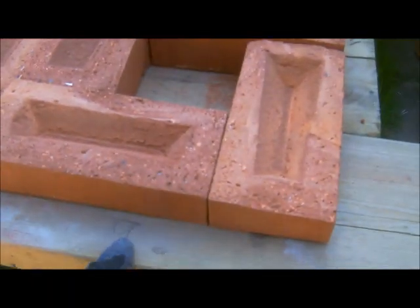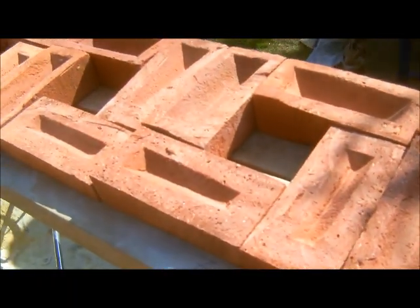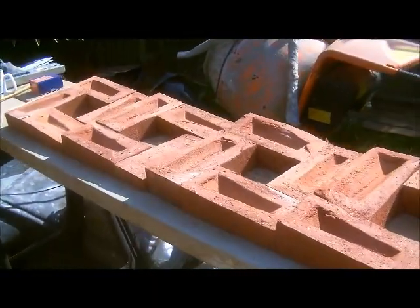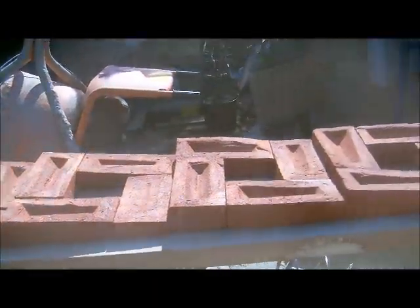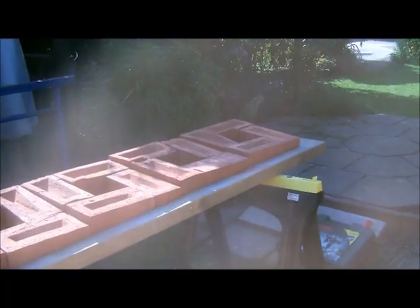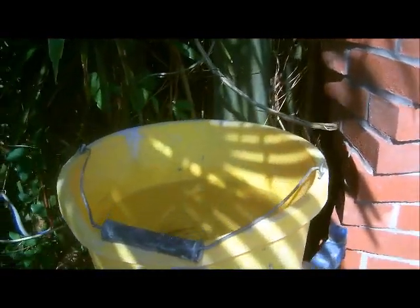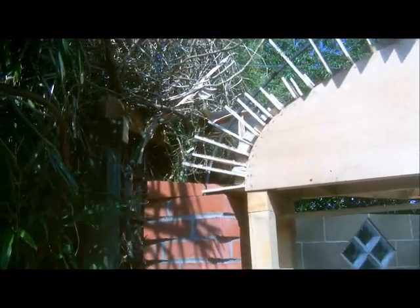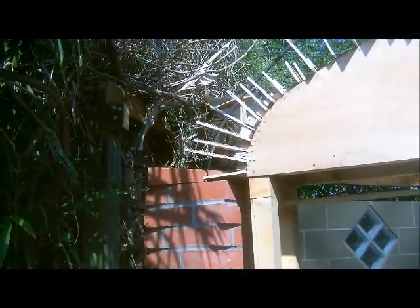You can see all these courses are numbered: 9, 8, 7, 6, 5, 4, etc. They have all been cut using our little template. On our scaffold, the mortar board has just been wetted, and there's a bucket of water just for dunking the bricks because it is such a hot day today, and we will start shortly.